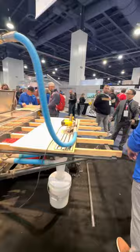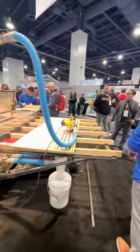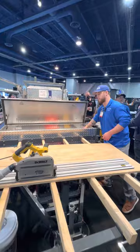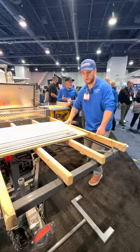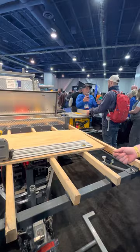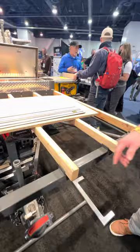These 2x3s are all built to store inside of this front box — above your vacuum and your compressor. Lid closes down and locks up. When you pull up on site, you pull them all out. You can set down a 4x8 sheet of plywood for a full table, or if you need to rip pieces off with your skill saw or track saw, just set your depth and let it cut through the tops of these 2x3s. They're sacrificial — you can cut through them a million times and replace them when you feel like it.